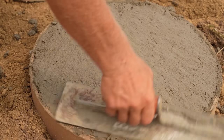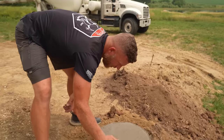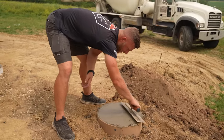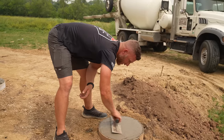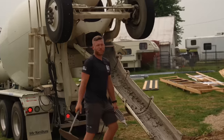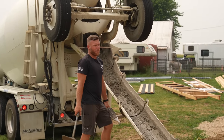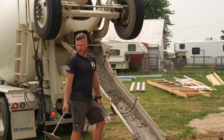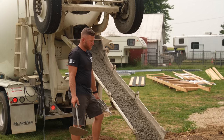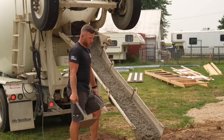I want these to be fairly flat — I'll probably come back and hit this again. I know I'm not using the right tool for this, but I'm not doing a polished floor here. This is probably a little bit drier than if we were doing the whole building site and I was trying to wet-set these, but since I'm just going to be creaming up the top and smoothing it off, this is perfect. I just go about my way and get her done real quick. And the less moisture in the concrete, the harder it will be with less shrinking and cracking.